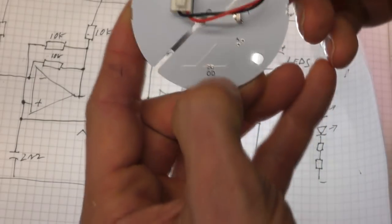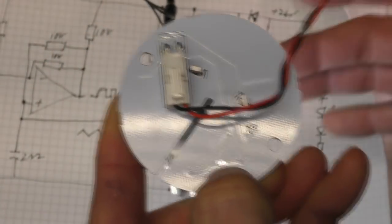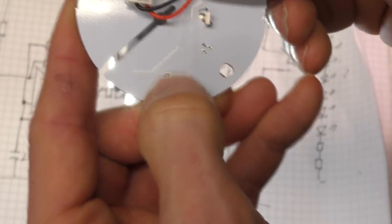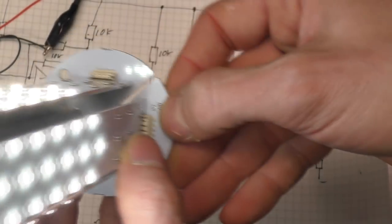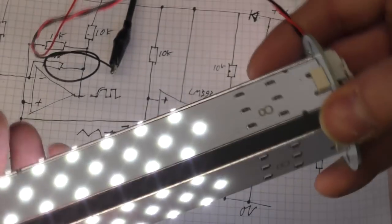The other thing I put on here was a solder bridge, so that if there was some issue with this limiter, maybe it was cutting in when we didn't want it to, we could potentially put a solder bridge on there just to completely bypass it. And again, that was put on the top so that it could be added on the assembly without taking these off, but also potentially could even be done after the thing had been assembled. It was just a sort of contingency.